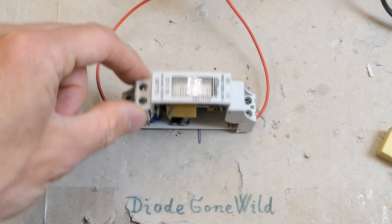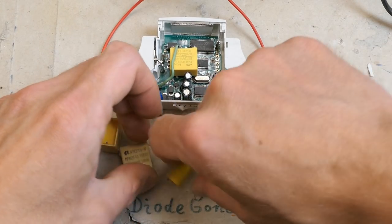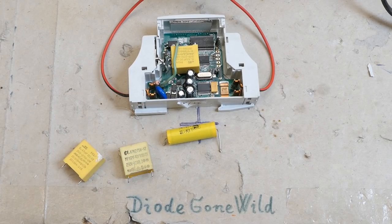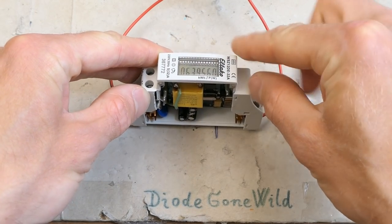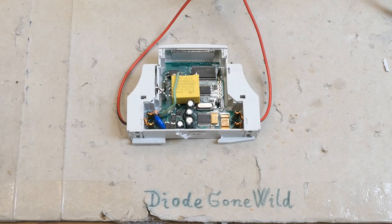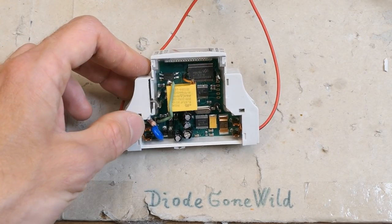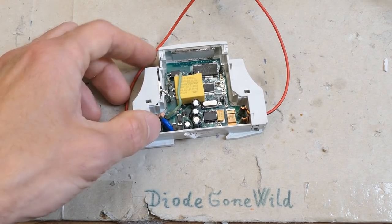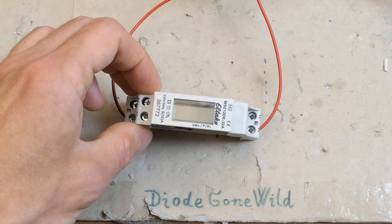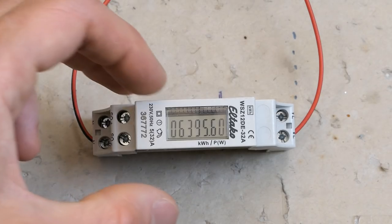So this electricity meter is working — it was just the capacitor. It doesn't have to mean these AC voltage capacitors are poor quality, but they are usually the most exposed components in an appliance, exposed to whatever mess comes from the mains. The other components don't see as many transients and over-voltage spikes. This meter measures real power by sensing instantaneous voltage and instantaneous current, multiplying the two readings, and integrating it. The ADC takes multiple samples per half cycle. I'm not sure how it stores data in EEPROM since EEPROM has a limited number of write cycles — maybe 100,000. A 7-digit display has 10 million increments, which is way too many writes if it stores every display change.